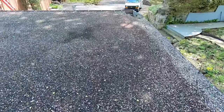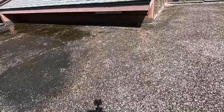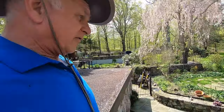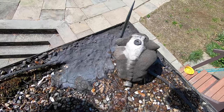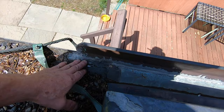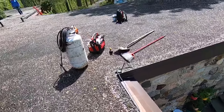There's no blisters. I've walked the whole roof, and therefore I still feel I can repair it. Now, a lot of people, what they do is they repair it and they just put tar over the gravel, like in this case. See the tar and there's stone underneath it — that doesn't work. You can see it cracks there, so that's not how you repair it.